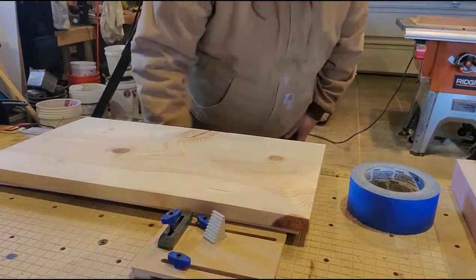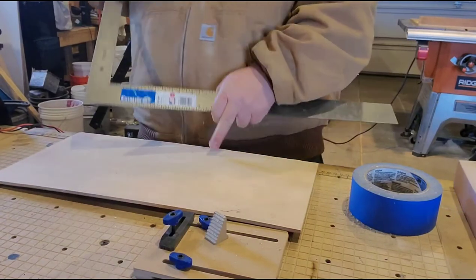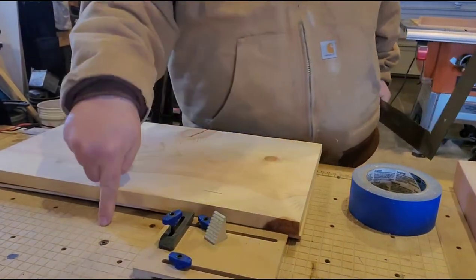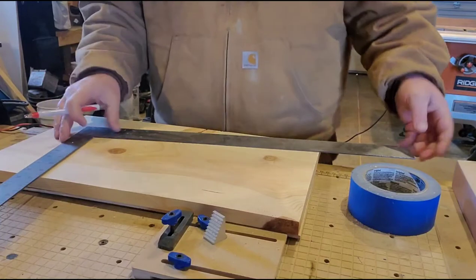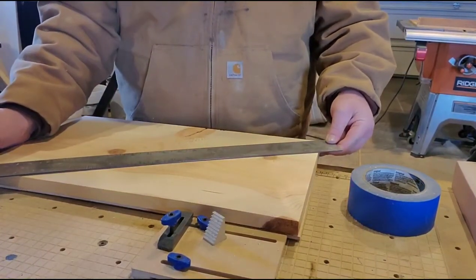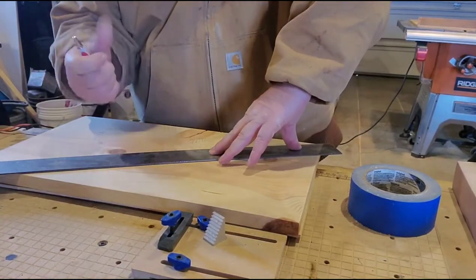Okay, now I got that cut out, and I got a piece of sacrificial wood on the bottom, so when I cut through this board, it won't cut into my wasteboard. Now all I'm going to do is measure for center, because that's where I programmed my G-code, and my image is off of the center. Doesn't have to be exact, but...